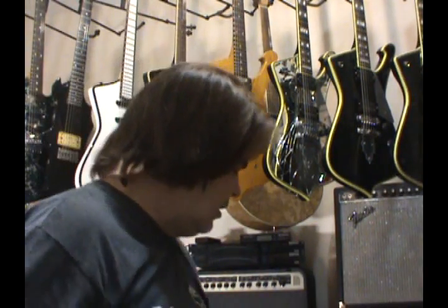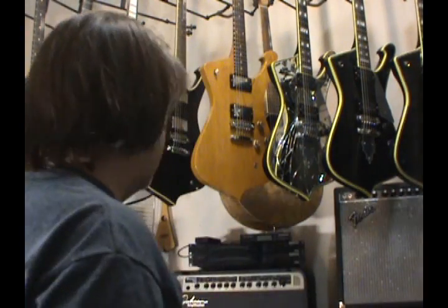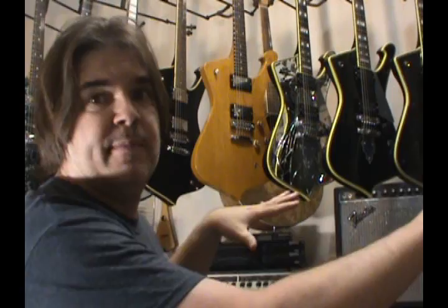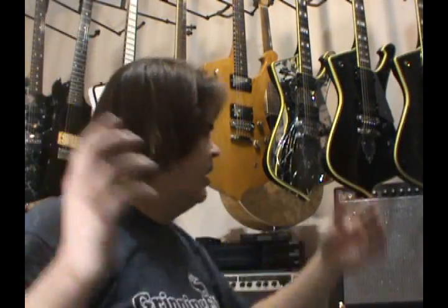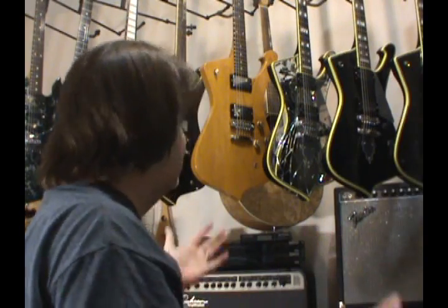The Marquee series in a nutshell. Again, the foot switches run off of a 5-pin, just a standard MIDI cable. $123 for the amp I just showed you, shipped to me. The other one's identical. It's just missing a 12, but it does have a second power amp built into it to put another external speaker cabinet on it. You can separate it as much as you want and have everything going right and left. And yes, you have effects loops in the back.